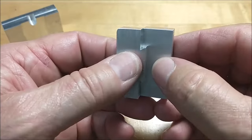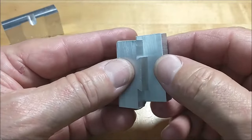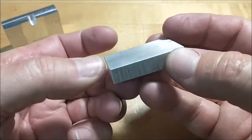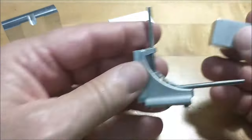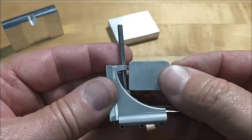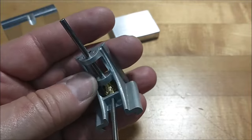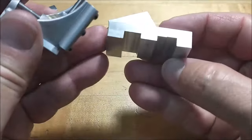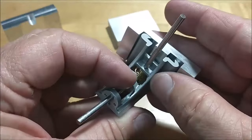Male dovetail gauges. Male and female, 875 theoretical. But when they go together, it's like invisible line. Love it. Little tombstone, headstone initially for clamping on the tapered surface here. That is no longer there. So sequence of operations, again, keep an eye on that. This part gets very fragile. And this nest right here, which was used for clamping it initially this way.